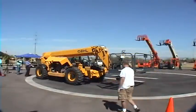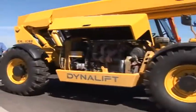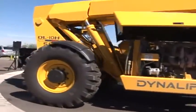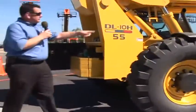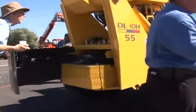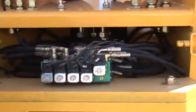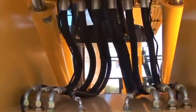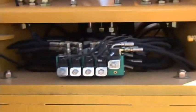Back storage, you get valve bank, counterweights, accessible right in the back part of the machine. We do have some big oversized boom cylinders which are back here, as well as slave cylinders for self-leveling and upward motion. Front right hand side we do have the frame tilt, which is pretty standard at 10 degrees, unless anyone already said they had 12, but 10 degree house tilt left to right.